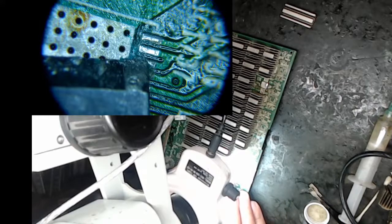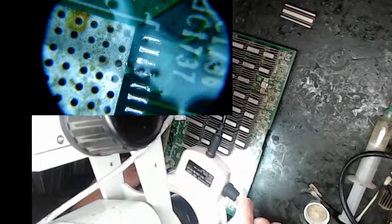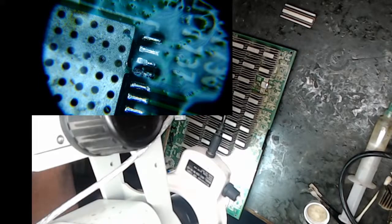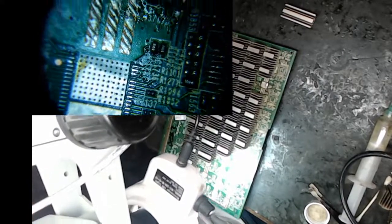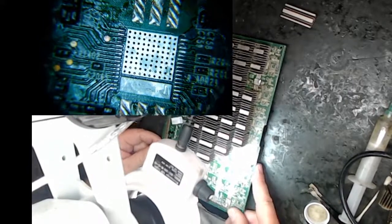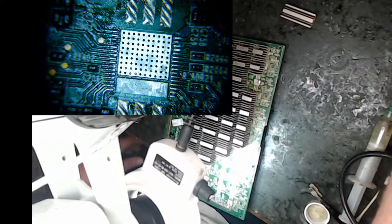So yeah, that looks pretty good. All right, so I'll be putting this chip on later. However, I wanted to get those ready. This guy, I'm going to zoom out here. I don't work on S17 Pros that much, so some boards you have to leave the heat sinks on when you put the chip on, some you don't. So this guy I need to clean up, so I'm going to start up my soldering iron, put it about 412.